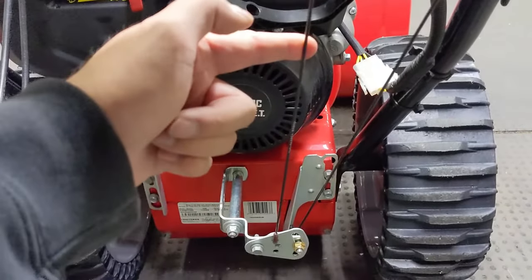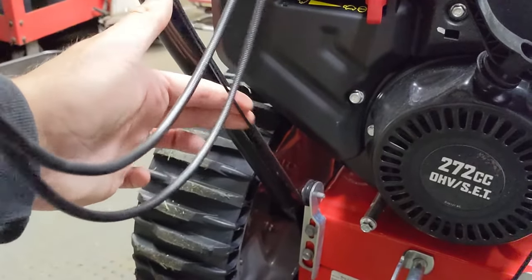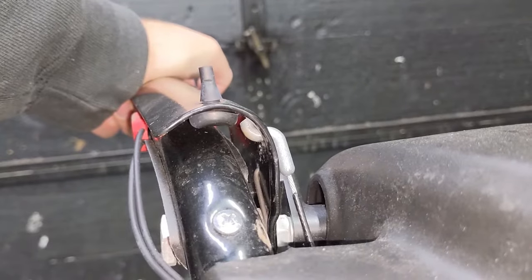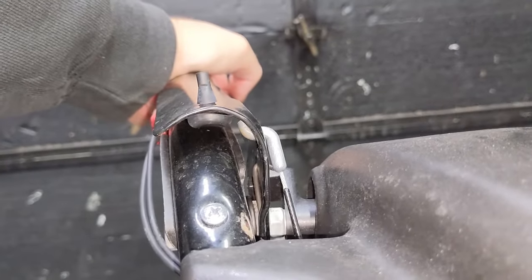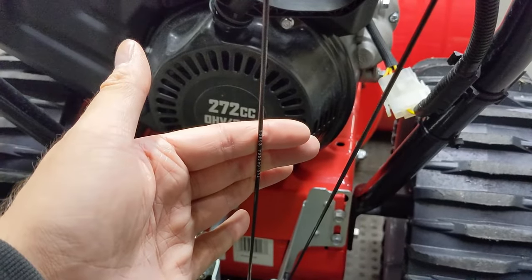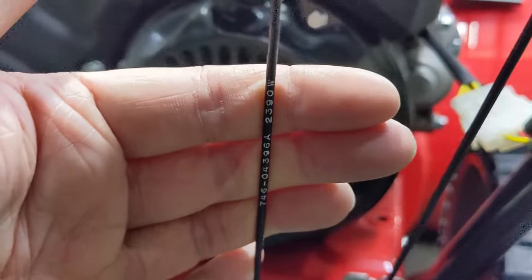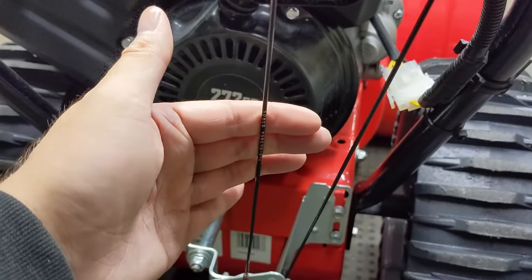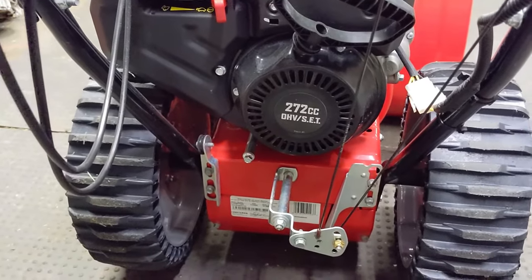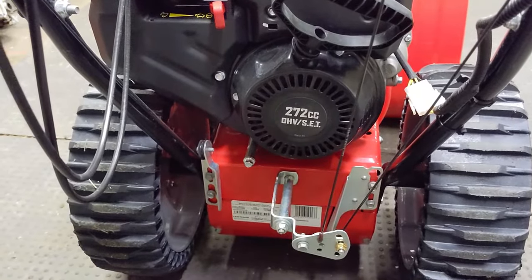They have a cable for the shift control, a cable for the drive, and a cable for the auger engagement. On the ends of the cables are a Z-bend, which hooks them into the levers on the handlebars. A lot of times that Z-bend can break because the metal used to form those Z-bends isn't very strong. The cable itself may also break, as these are quite thin cables and are prone to breaking. There is usually a part number listed on the cable, making replacement fairly easy. Cable snapping is not going to be an issue on much older snowblowers, as many of them use a solid metal rod with an adjustable tie rod-style end that you will usually never have an issue with.